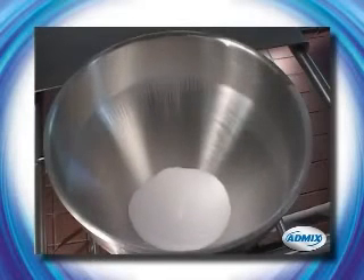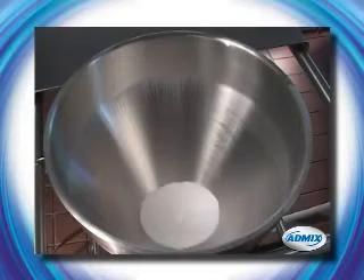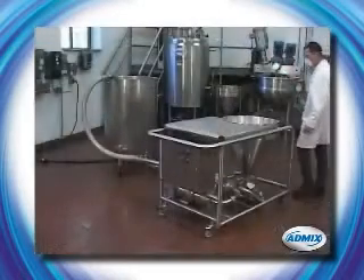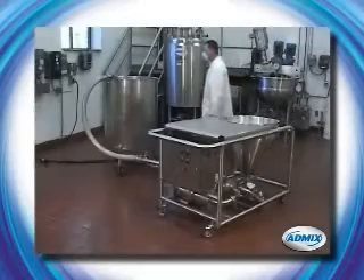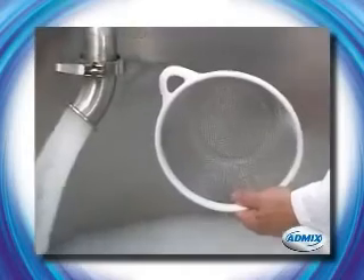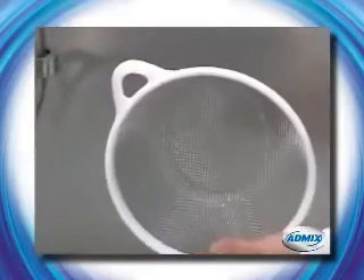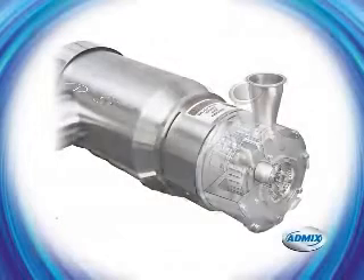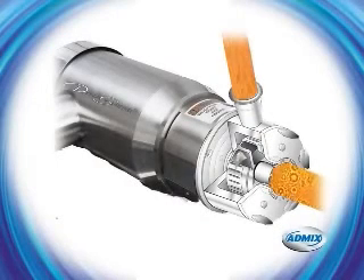This ensures the correct solids concentration as the slurry enters the inline Dynashear dispersor. The Dynashear will instantly wet out and disperse the powder-liquid slurry, creating a completely homogeneous product as the liquid stream exits the FastFeed system. With the unique advantages of axial and radial rotors and stators in series, most slurries will be completely blended or dispersed with a single pass.